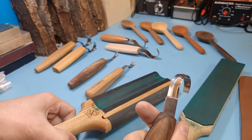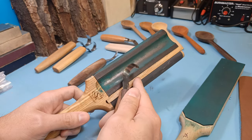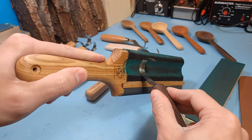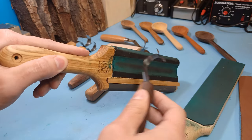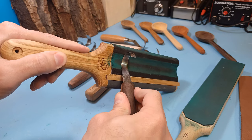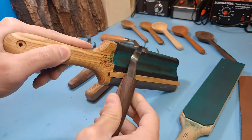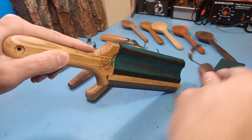When you're honing your hook knives, all you really need to do is take your hook knife, align the edge to the surface so it's nice and flat, and then just push it along. You don't need to apply a lot of force — it'll do it on its own. I like to rotate mine around while doing it, and as I said, the curved surface allows it to cover more area at once, making the whole process faster.